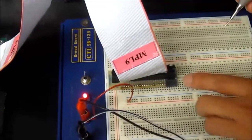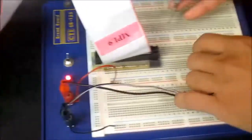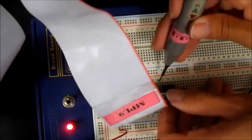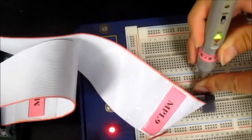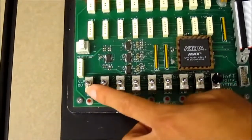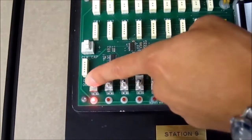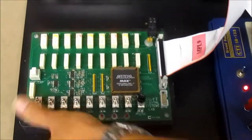After we've hooked our header up, we can test that our switches are working using our logic probe. If we look at our handout, we'll notice that pin 1 corresponds to switch 1. So when we put our logic probe there, it's going to say logic 0, and when we look at switch 1 it's low. If we were to switch this to high, we should expect the tone to go high and logic 1 to be output — and there we go. We know our switch is working.